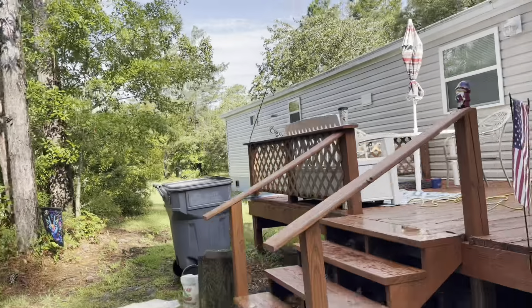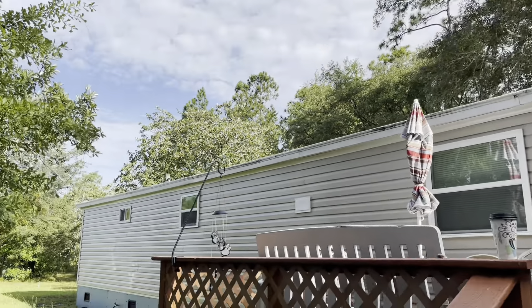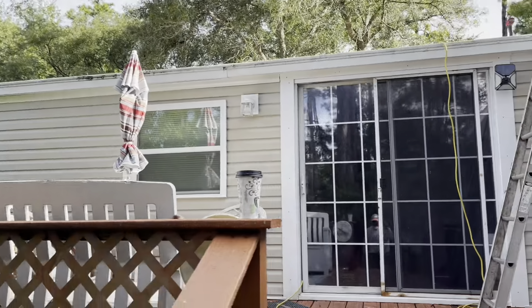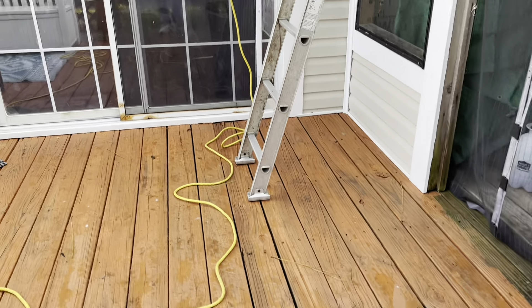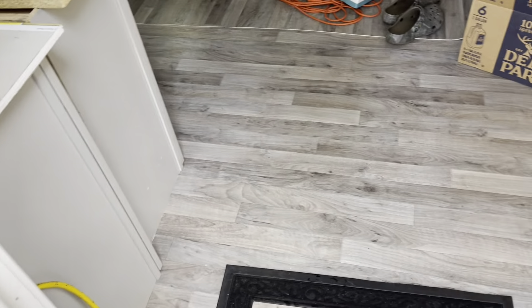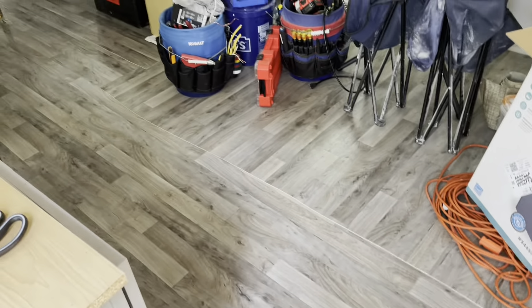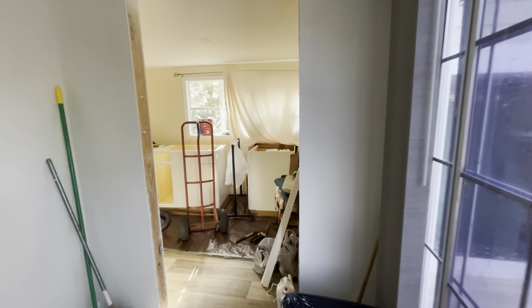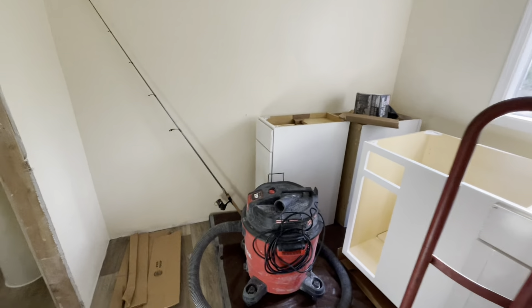Let's take a walk on the inside. Paul and I came in here and the first thing we did was the roof — tore the roof off and gave it a brand new rubber roof with the overhang like we do. We did all the underpinning. We came in and did all the floors — removed all the floors actually, and redid them. This is what it looks like now, still a work in progress. They changed the door frame. The bathroom was right here, and there was actually a closet and a dresser-type thing built in there.